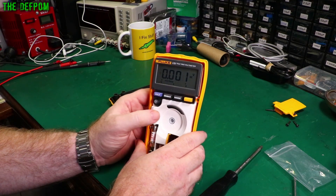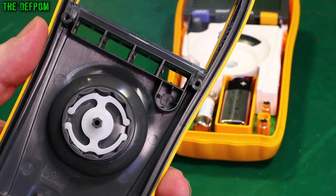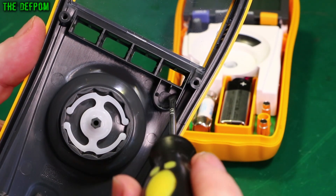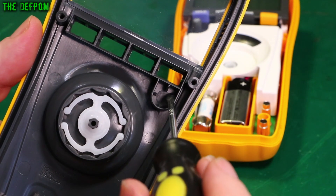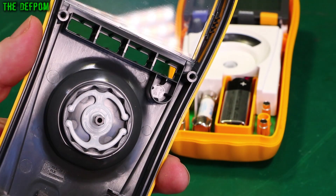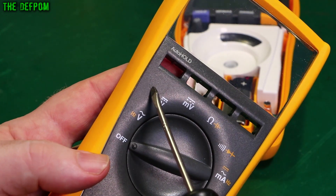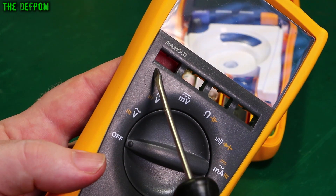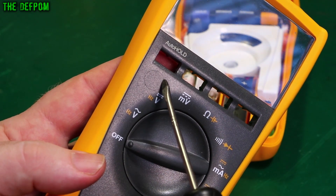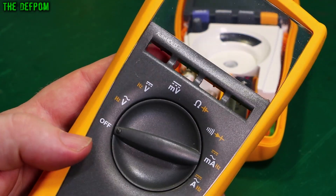So now I need to modify the front panel. You can see that round section just there. I can't tell if it's an insert inside the mold which they then changed to blank, or whether it's a blank inside the plastic. I think it's probably an insert inside the mold - that's the way I would have done it if I was designing this thing. But you can see a witness mark around the outside there. Because it's got this rounded radius edge on the original, I don't think that's an insert - I think it's part of the mold. So I don't think I'll just push this out, but we'll give it a push to see if anything happens. Nothing happening - that is molded in. So we need to drill it.